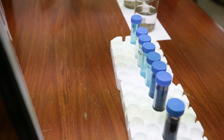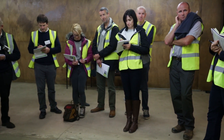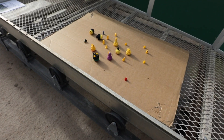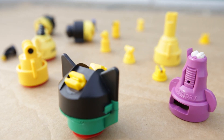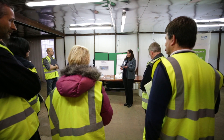The really important thing is to look at your methods for washing the tank, make sure you've really got it clean. Use dyes and other materials to try and check, as we've done here, just to confirm when you've actually cleaned things out. Don't be afraid to dismantle your components, take your nozzles out, soak them to make sure you've got all that residue out. Another approach — probably easier and taking less time — is to use a second tank dedicated to the biopesticides.